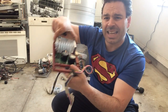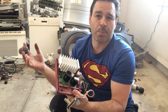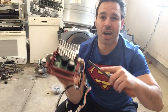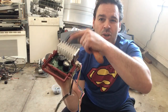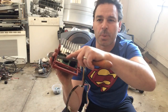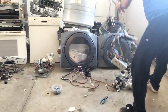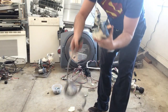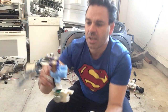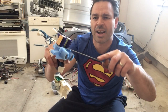If I was to bring the heat sink in whole with the circuit board, I'm just going to get the electronic weight price of $0.05 a pound and lose a lot of profit. So you want to make sure you upgrade — take off any copper spools on your circuit boards and aluminum heat sinks. I also have a couple of really nice smaller wires here. These two plugs have a little bit of copper, and I'll have an upcoming video showing you how to remove that copper. There is some brass in those plugs — yellow brass is going for $3.25 a pound.